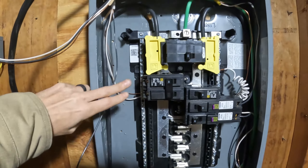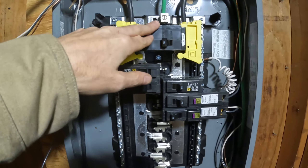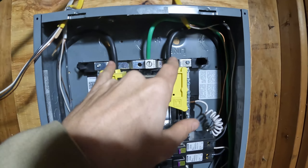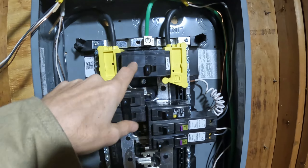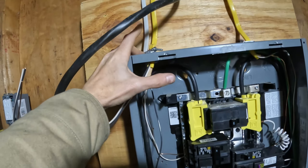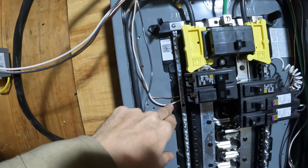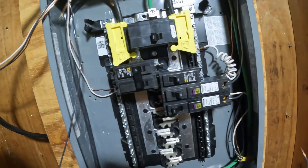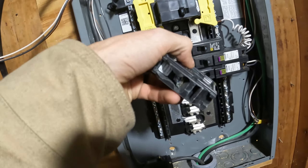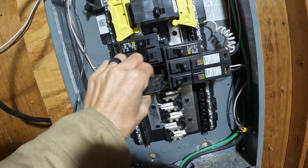Taking a break. I'm going to hook the wire from the lights into the breaker we're going to use for it. Before we do anything, always shut off the power to the box or to the electrical circuit you're working with. The lines from the house — these two black ones are still live because I didn't shut it off from the house, but I shut it off here, so all this is dead. I took the white wire, ran it into the box, secured it with a connector, stripped the white wire off, ran the ground and the neutral into the shared neutral bar. The last step is wiring the black wire — cut it down, wire it into the breaker, secured. Then once it's wired in, you just snap it right into place.